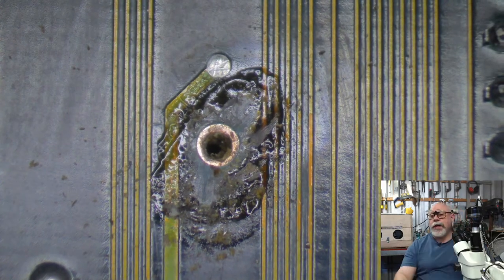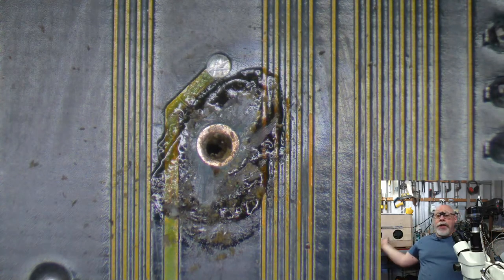But what I did find out, this is what I discovered, was that if they fell off when I wasn't watching, so for instance, I leave this for half an hour or something, and they fall off at some stage during that ultrasonic clean, having those transducers working, not stuck onto the bottom of the thingy, that's what causes the transformers to melt on the power supplies, and that's why I had to go in and repair them.